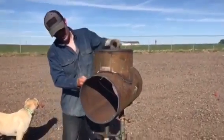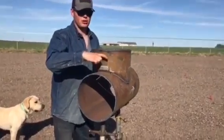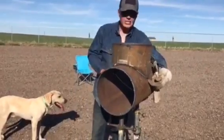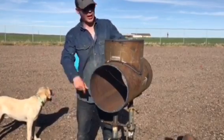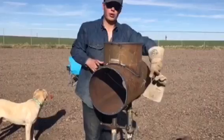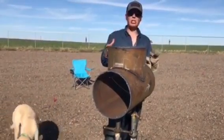And then you're gonna come right here, and you're gonna wanna tack both your throats first, okay? That way if these ears are too tight, you can always take a wedge, beat the wedge in here, open these up a little bit, and then run two tacks on both sides of it. So four total. What that's gonna do is hold everything in place. It's still gonna suck up a little bit.